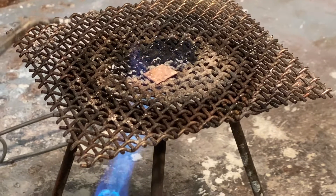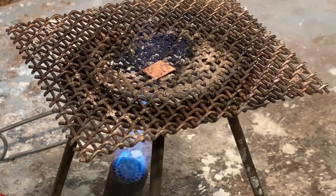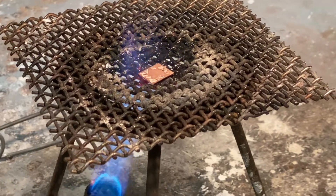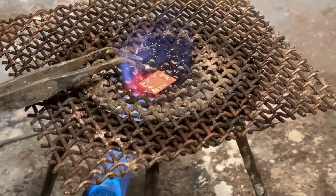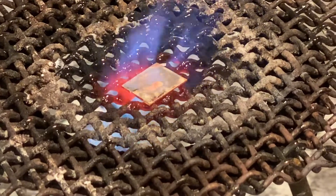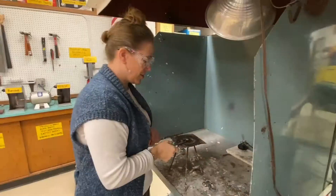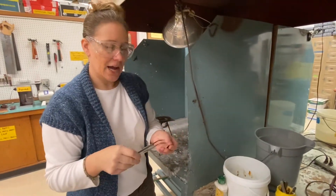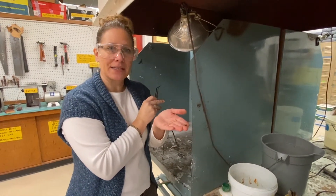Now that I've turned the light on, you should be able to see — what will happen is the metal is actually going to dance almost a little bit, and then the solder is going to flow. I can see I missed — there we go, the solder went every which direction. As soon as it melts, you pull the flame away. I'm going to take my piece, quench it, and then go in pickle before I can put the two pieces back together.